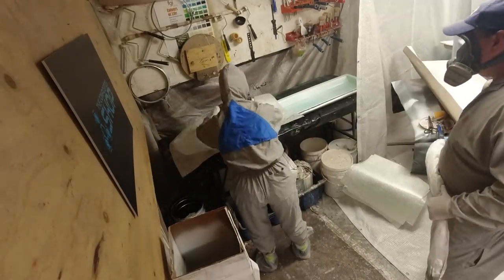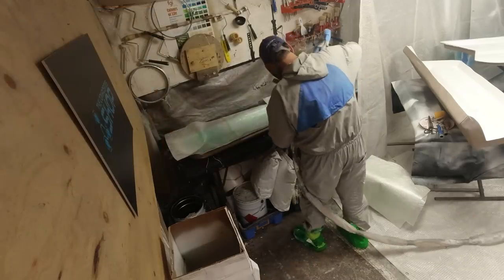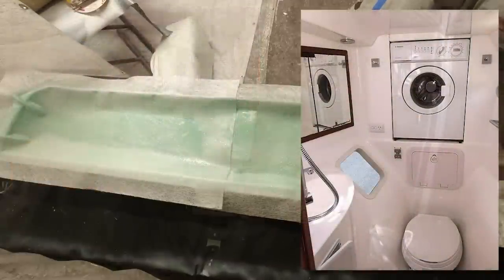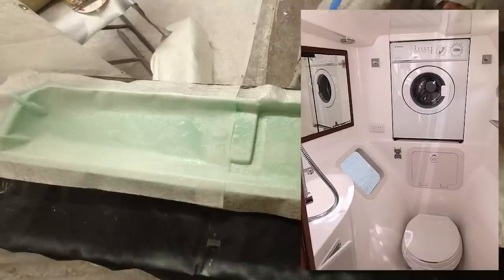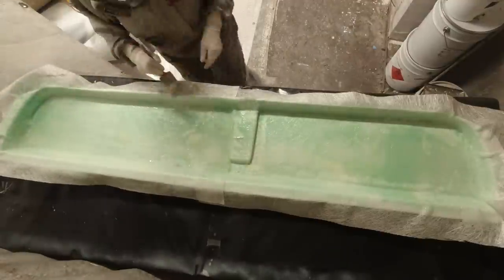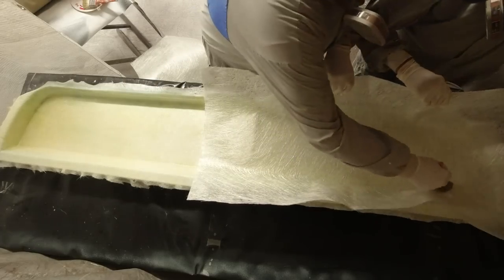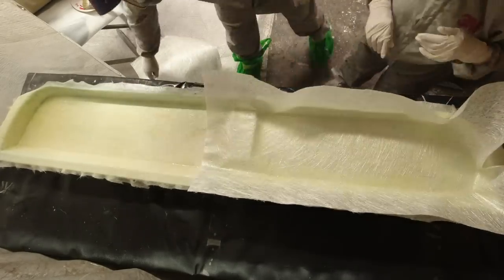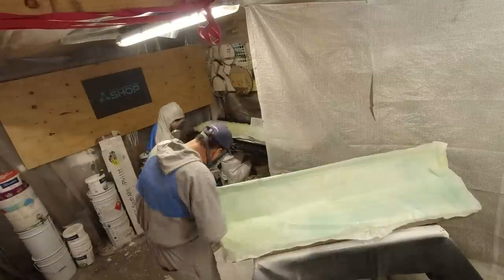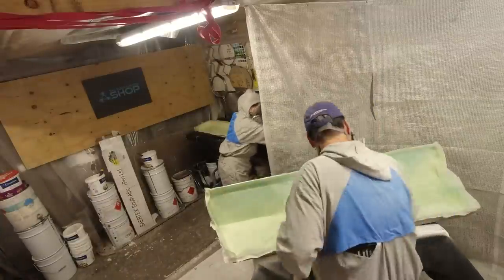The parts we're fabricating here are the roof linings for our port head and an additional single panel to complete the lining on the starboard ensuite head. These are lining parts requiring minimal reinforcement, but they must be substantial enough to be secured overhead without any risk of drumming or vibration. They also have to be easy to clean. I'm not looking forward to working overhead and trimming them. I may have to make further templates to get the shape exactly right, because I don't want to go chopping them — particularly if the molds are gone. That process took a couple of hours. I made them in three layers: two layers of 300 and then a layer of 400 double bias to finish them off — very light, very simple.